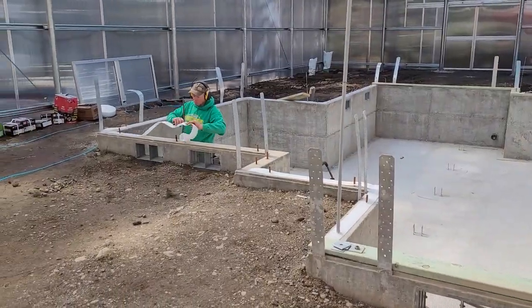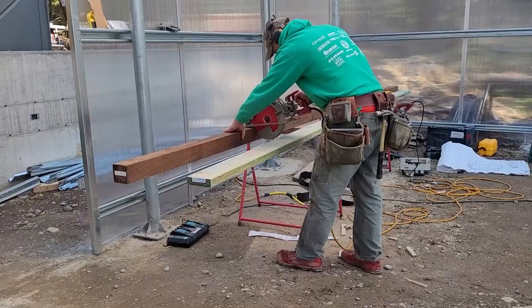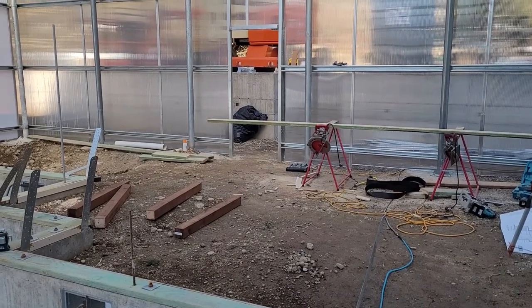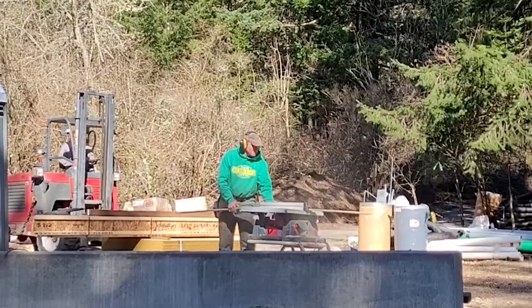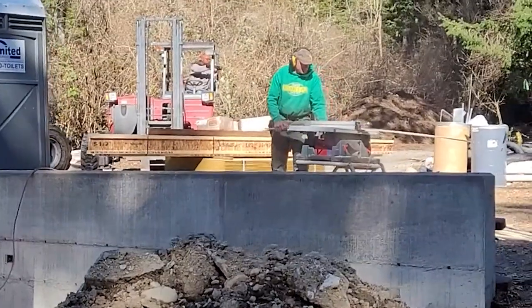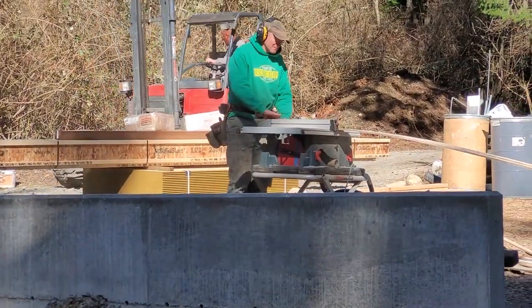Mike lays insulation to seal gaps between the concrete and sill. Then Mike measured and cut the post that will hold the beam supporting the floor joist. I wasn't expecting a second material delivery on the same day. This one includes the floor joist. Glad they're here today, since Mike will be ready to install them tomorrow.